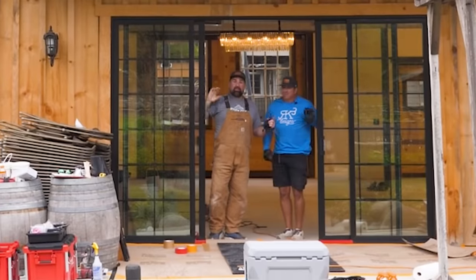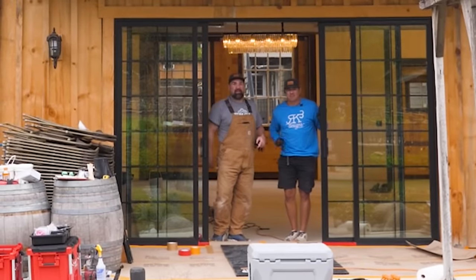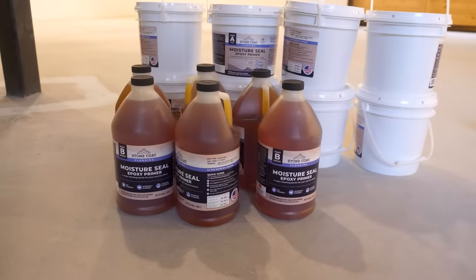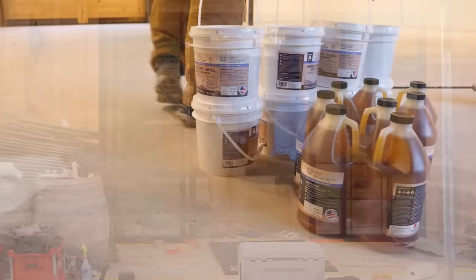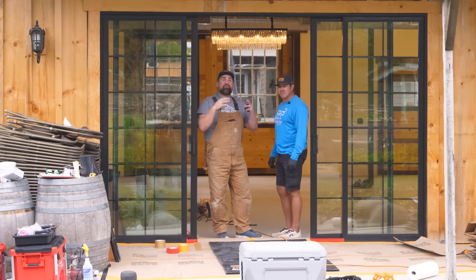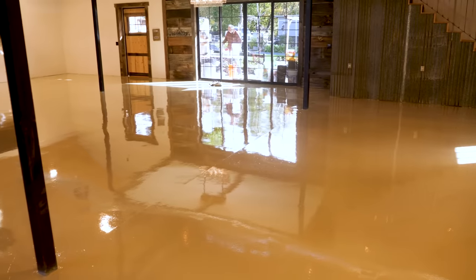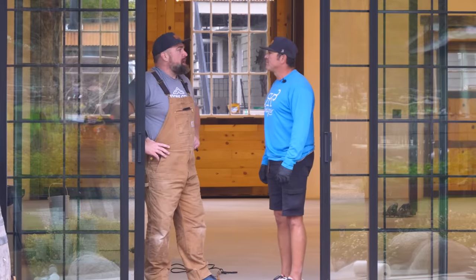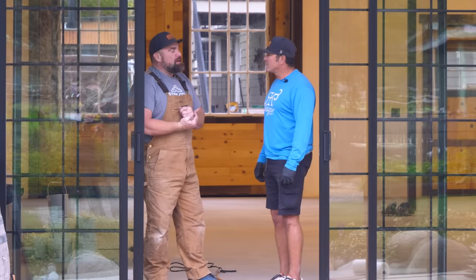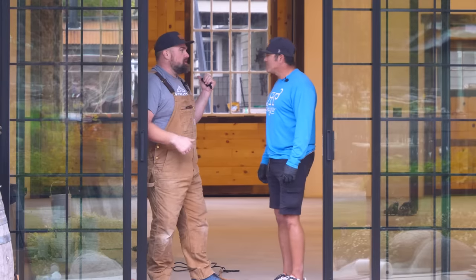We're back from lunch and ready to lay down that moisture seal epoxy primer — that's our foundation coat. That moisture seal is going to penetrate in like tree roots to the concrete we just opened up with that fancy diamond grinder, bond to the concrete, and allow us to proceed to the next step. That'll set up overnight. If we're back here before 24 hours, we won't need to sand this floor, which is crucial — it's a big floor.